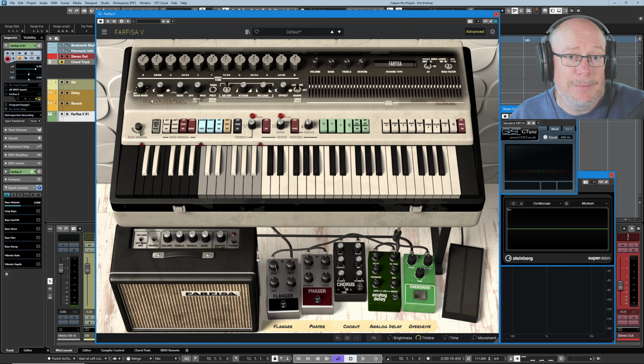Essentially, all of the same named notes were all generated from the same oscillator. A side effect from this is that they're all in phase. Every single C that I press on the keyboard is basically coming from the same oscillator, and so they're all generated from the same position on the phase curve. So you never get any unison detune. Watch.